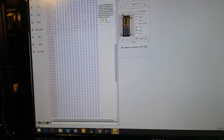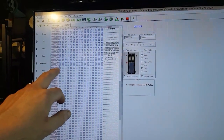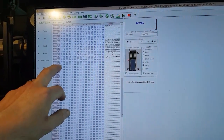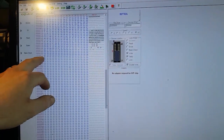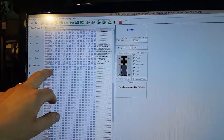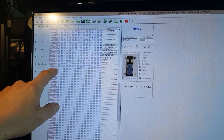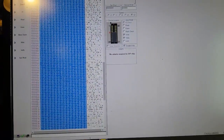And we're just gonna copy double the code inside. So it goes to 7FF, and it's 8K essentially, or is it? No, it's less than that. 4K, is it? Can't remember. And then here. Yeah, it's a 2K ROM, the 16, and then the 32 is a 4K ROM. And then from the other half, we're just gonna copy the entire code again.